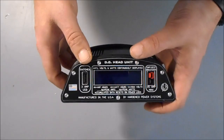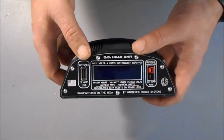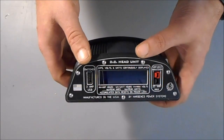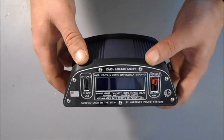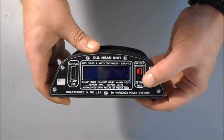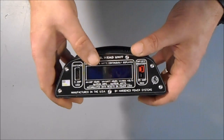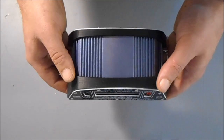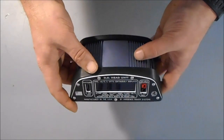And we think that makes sense. You could have a rig that has a significant initial amp draw, or a rig that already has some sort of fuse protection built in, so the circuit breaker would be redundant anyway. But that does allow us to rate this at 35 amps very comfortably, and the meter will handle actually a lot more than that. So no worries about the equipment being able to protect itself if you put unprotected DC in through the back.